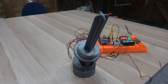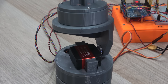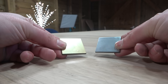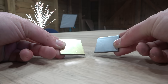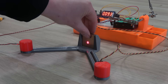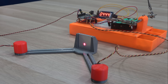Luckily, while working on a test setup for the solar tracking mechanism, I came across two components in a forgotten box of parts: a sensor that can measure light intensity and a small laser module. With these we could still use the spray painted mirrors to test whether gold or silver works better. I spray painted two small acrylic squares — one gold chrome, one silver — placed each in a test setup holding the laser module and light sensor, shone the laser beam via the mirror into the light sensor, and measured the light intensity to determine exactly how much the two differ in reflectance.